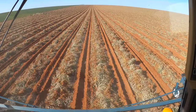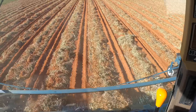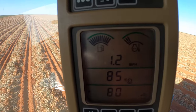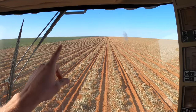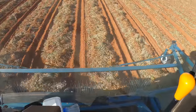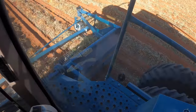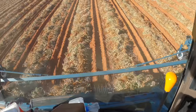We made a slight adjustment — we turned down the cleaning air just a little bit so not as many peanuts fly over the back. Now we're back to harvesting. We got mile-long rows here, going 1.1 to 1.2 miles an hour — do the math and I'll be at that end in about an hour. Peanuts are doing not too bad; there's a decent amount on these plants and not getting too much header loss.